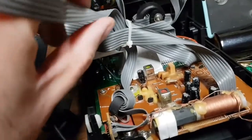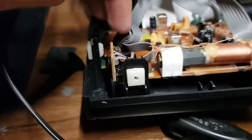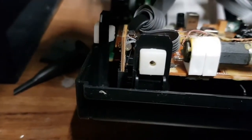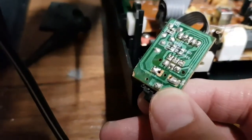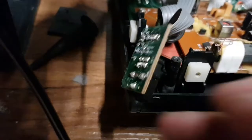This connector goes off down here through this ribbon cable, through this RF suppression inductive ring, then on to this little vertical board. And if you look on the other side, it's the headphone jack. So why would you get induced noise in the headphone jack? It's a little bit odd. On that board is literally just the headphone jack and nothing else - a little board, headphone jack, some inductors which are ironically for noise suppression, and some resistors and caps on the bottom which are also probably for noise suppression or maybe leveling. I don't know why it should be inducing the noise there.